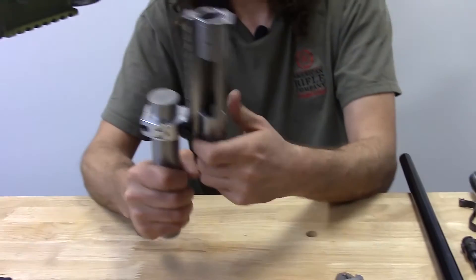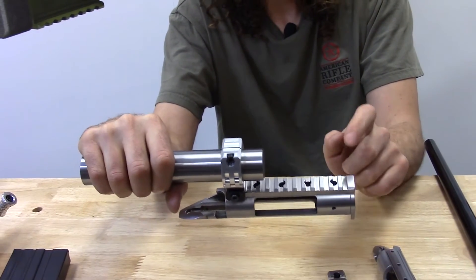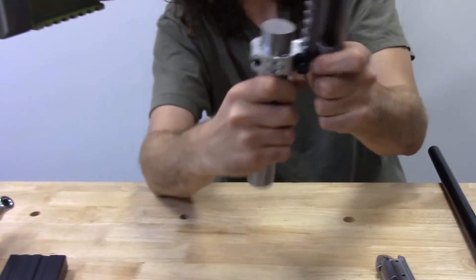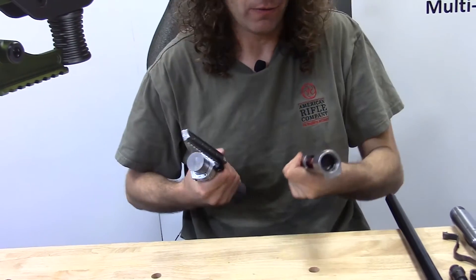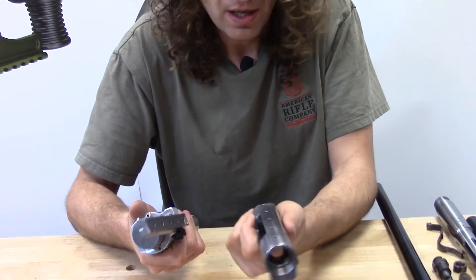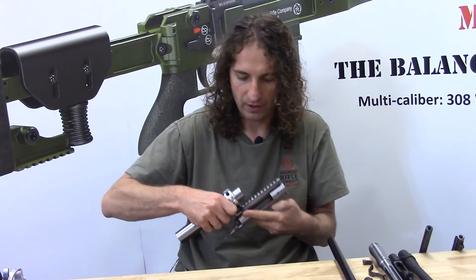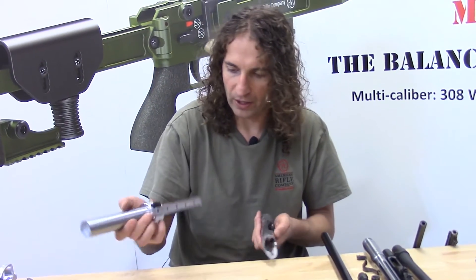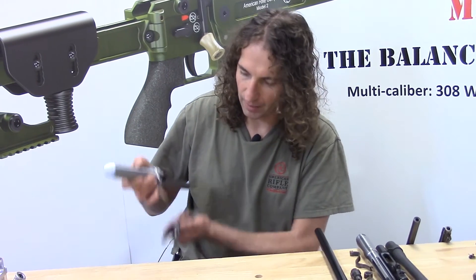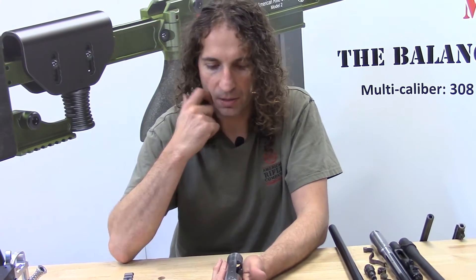Here's an example. The rail was bolted to the receiver; the bolts have now been removed and you can see the rail is still attached to the receiver. Separating the two requires considerable force — as you can see, I pulled pretty hard to get them apart. In some instances I can't get them apart that way, so I'll attach a scope ring to the rail and tap them on a table. The inertia of the receiver will break it loose from the rail, like breaking any other taper. It takes a considerable amount of force.